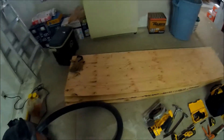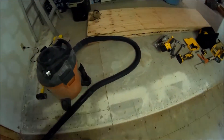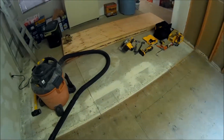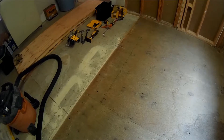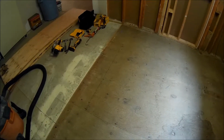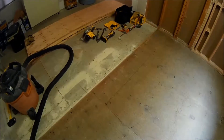I chose CDX plywood — simple basic grade rough plywood that we use for sheathing and decking. I don't particularly need underlayment and I don't like underlayment. If it was my installation I wouldn't do the underlayment. I might do straight up plywood — one inch thick with a tongue and groove on the edges — as my decking. But it's someone else's house, so this is what you end up doing. I'm gonna fill all this in and let's get started.